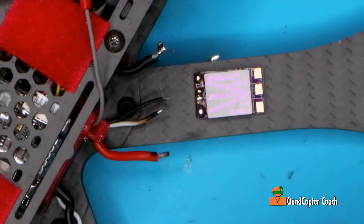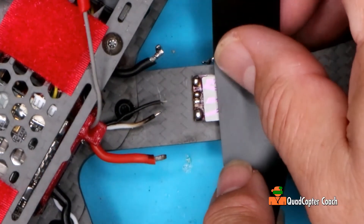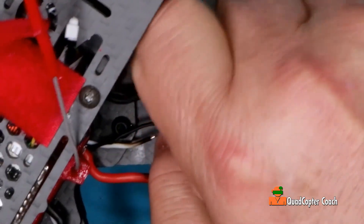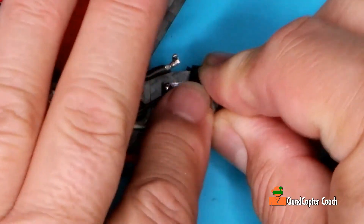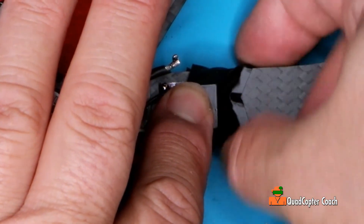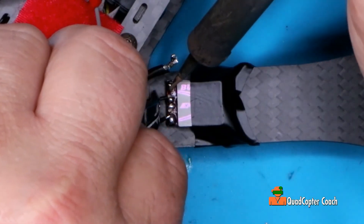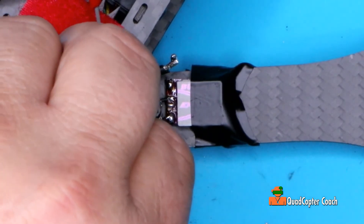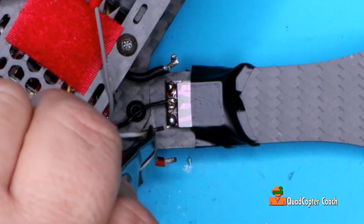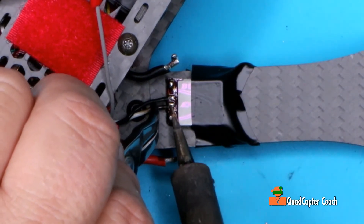Now that we have that, let's bring our quadcopter back and put this on. Now we're ready to put our ESC in its place. Before we do, we need to tape it down while we solder. I'm going to take a little electrical tape, put it on here, bring it up to about where I want it, and just tape it down so it doesn't move — this is just temporary. Now that we've got our electrical tape there, make sure there's nothing in your way. The white one — the signal wire — goes down there. Make sure these do not cross or you'll have some bad stuff happening.